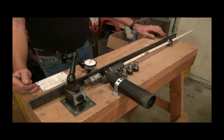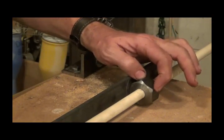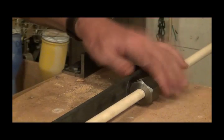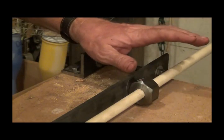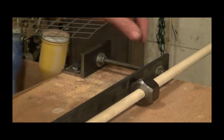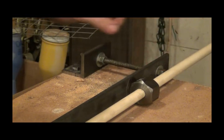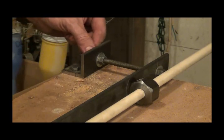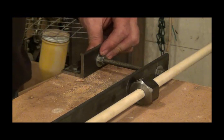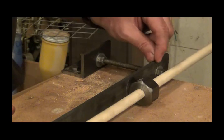Let me show you this end down here how I will be adjusting it in and out. I made another nut down here out of the same material to hold the whip guide, to keep the shafts from spinning and whipping and breaking when they come through. They shouldn't spin too much anyway because you want them straight, but when you're spinning them with a drill they will start whipping. I took a piece of all-thread and bolted it onto here real tight. And then when I want to adjust it, I will loosen this and adjust this end in and out from here watching my dial indicator — my Starrett dial indicator — that's set against the angle iron right at the cutter so I can adjust it exactly the amount I need.